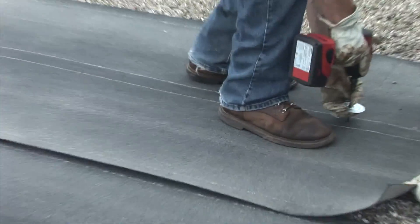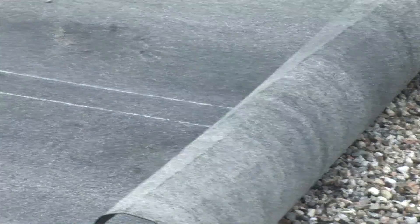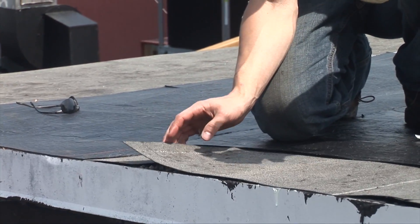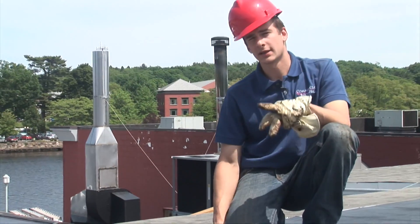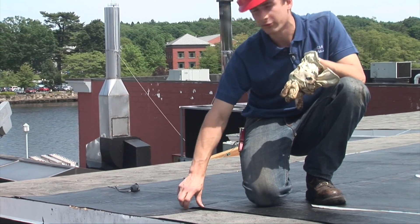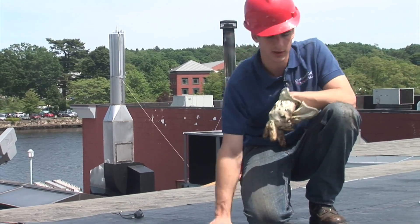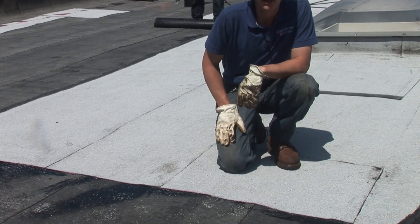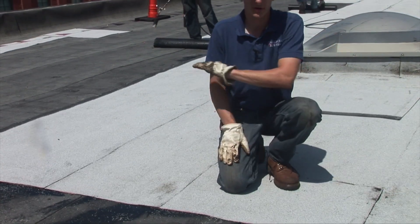It's just as good as if we stripped it all the way down. You get the same warranty, but this is one of the most cost-effective ways to do it — both with time, labor, and debris removal. I've already laid down my fiberglass liner and anchored it down. This gives the roof the strength and stiffness it needs. This is the first of the two-ply: a self-adhering base, and you can see it's already starting to adhere. The two-layer membrane, as well as the protection of the fiberglass liner — you can't beat it. It makes it one unified membrane all across. There are two advantages for installing a new membrane in this case: A, there is no cost for stripping and removing the old membrane; and B, fusing an additional membrane over an old one creates a roof that will last well beyond 40 years, unlike the 15 to 20 year life expectancy of EPDM and TPO single-ply roofing systems.